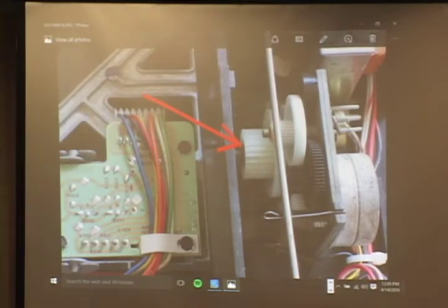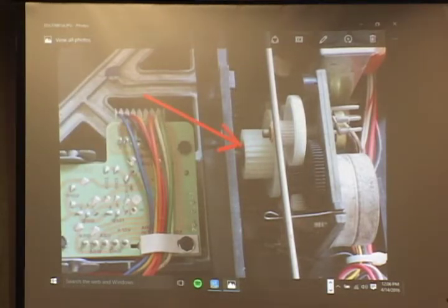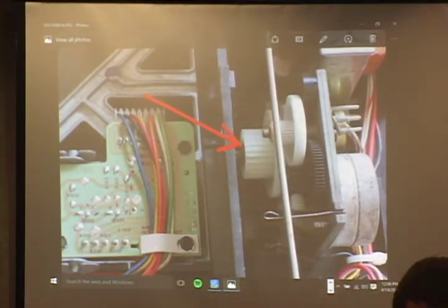This is what's called the third reduction gear. If you've received a player where someone has not put in the shipping tags, chances are that the stylus arm has gone back down. It rubs against that gear and breaks it. It's a cartwheel gear with little spokes in there. It's the white one right here. I'm passing it around. That's a broken one. If anybody wants to pick some up, I brought some with me.